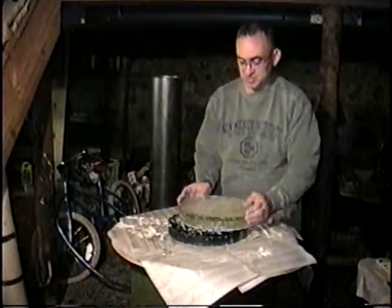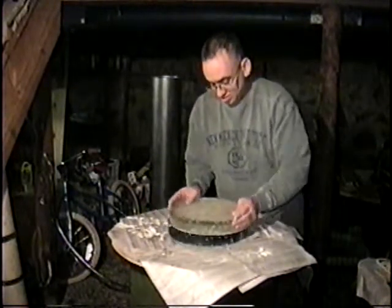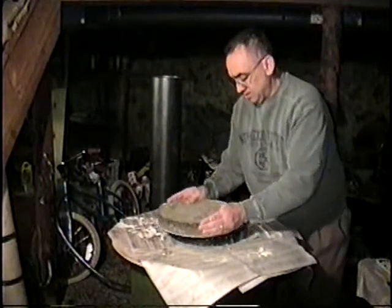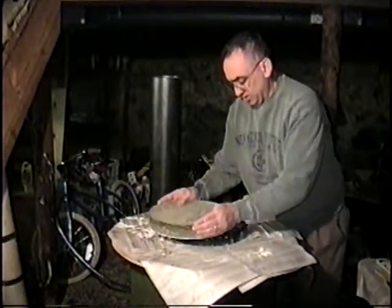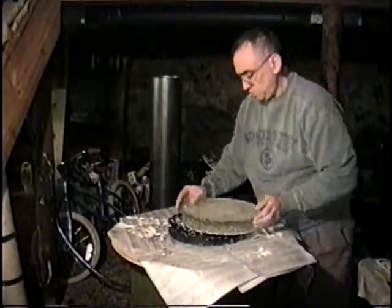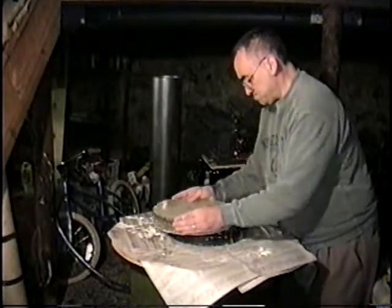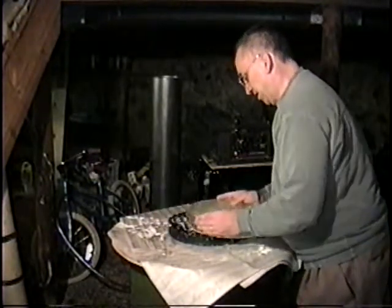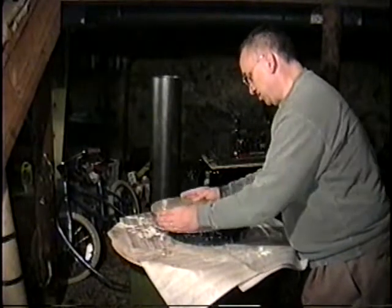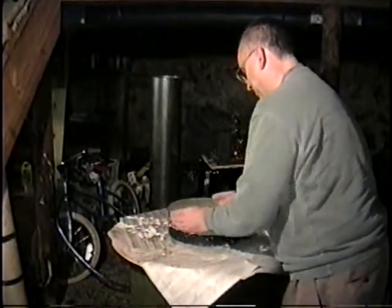And now my mirror is gliding slowly, gently across the pitch lap. And I'll keep it up for about a half hour with the mirror on top, probably in 15-minute intervals. Then I'll switch to the tool on top, go for about a half hour to hope to keep the figure spherical just by alternating mirror on top and tool on top.